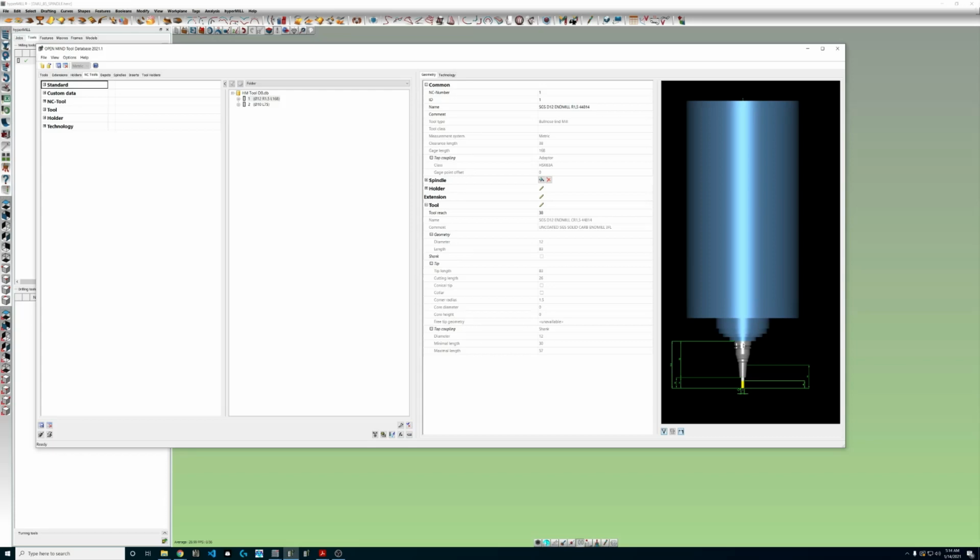If we're working at 110 or 120, we're hitting those big negatives. This is super helpful. Also people with big machines. I have big machines and I work on small parts, so it's not often that I would ever have a tool holder assembly where the spindle would actually clear the table. Usually I'm having to put my part quite far off the table or high on the table, so when I'm tilted, it's sticking out really far so I can get the entire spindle column down in front of the table. This gives me another tool to kind of help get that good tool path on the first shot, instead of hopping back and forth between simulation and toolpath generation to find that sweet spot where everything clears.